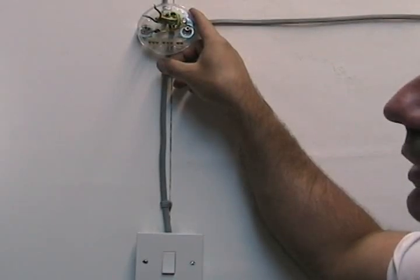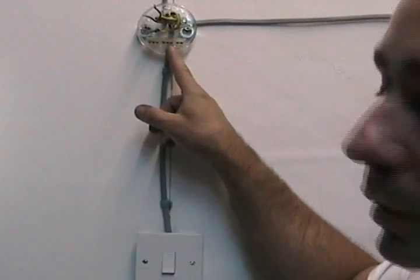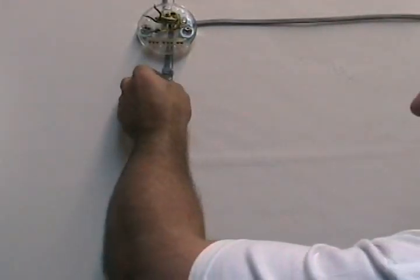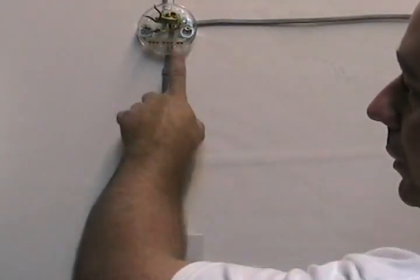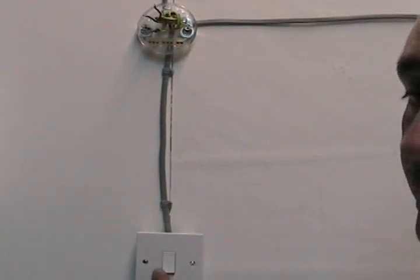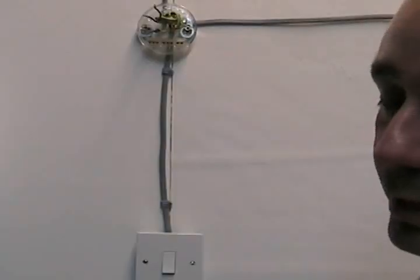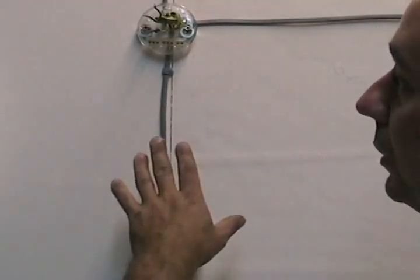If it's in the mid circuit, you may get a couple that won't work properly. So you need to know how to wire up a ceiling rose, and it's really not that difficult once you know what you're doing. This wire here is what we call the switch wire — it just goes to the switch. You have a live wire going down to the switch and then it returns back up to the ceiling rose, and that's what's called the switch live wire.